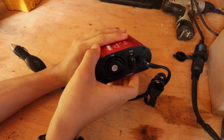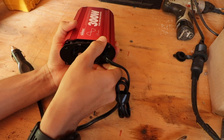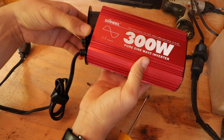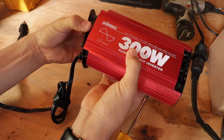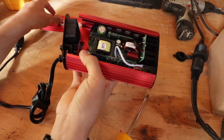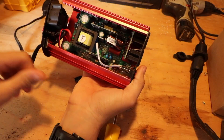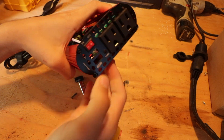So I'm going to start dismantling this to see what I can do about those problems. The connection seems to be pretty tight in there, but I noticed that there is a screw right here so I should probably undo that. This top part slides out, but it's a little hard to slide out. Now we can see the internals — it looks relatively basic but overall it doesn't look super bad, no obvious cold solder joints or anything.